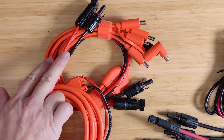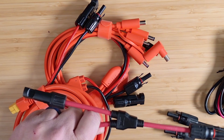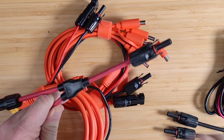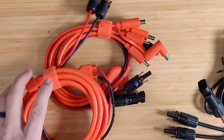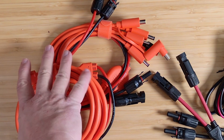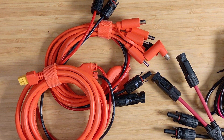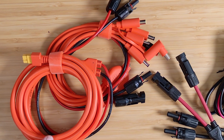An extension cable has the exact opposite on the other side. So on the red leg you'd have female on one side and male on the other. You get a length of wire — maybe 10, 20, 30, or 40 feet — with those connectors on either side to extend your adapter all the way out to wherever your solar panel is. Once you start extending things, check the wire gauge, listed as AWG. The smaller the number, the thicker the cable — AWG 10 is thicker than AWG 14. Thicker cable means less voltage drop over a long run, so for a very long extension (like 50 feet) you may want a lower AWG number. Also, if you have a large solar array putting out a lot of current and power, you'll need a thicker cable to handle it.